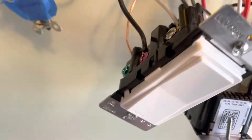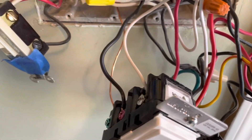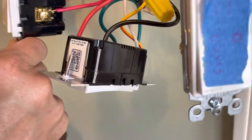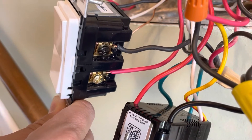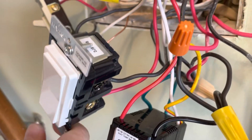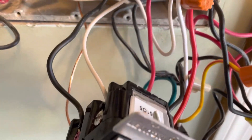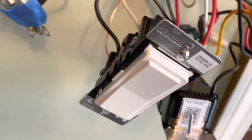Back down at the base of the stairs — this black on the red screw is the black wire going upstairs as part of my three-wire bundle. On the other side, the black on top is the line coming from the box downstairs. The red is the traveler going upstairs. And then the white — I've just got a pigtail here to tie it into my white bundle, but it is connected. And then the ground.